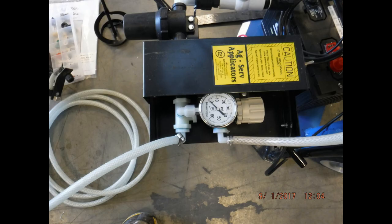We have a couple variations of the pump, but it's always mounted below the tank and there are two liquid paths coming out of the pump — the spray hose and a recirculation hose. The spray pressure is regulated by controlling how much liquid flows through the recirculation hose.